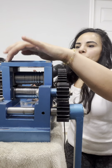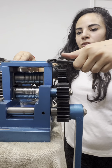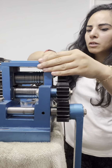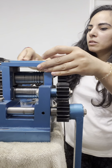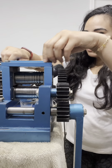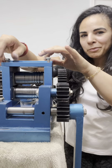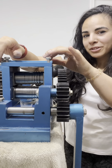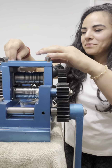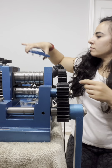And then we just have 4 little bolts that we take off on top. So I just use the wrench to get it started and then do everything else by hand. Actually, I didn't really tighten them too much last time, so they're pretty easy. I also don't recommend wearing a white top when you're doing this because there's a lot of dirty grease on these things, but we're gonna live life dangerously. So once they're able to come out, just lift your whole top off.